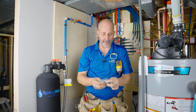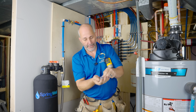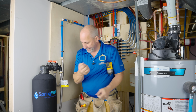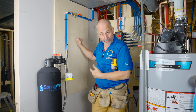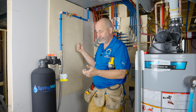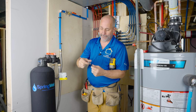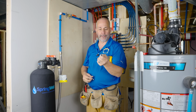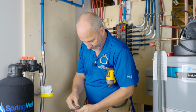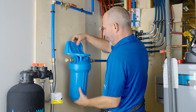All right, guys, now they come with a package of mounting bolts and washers. Hurrah. Hence the need for the plywood, okay? If you just have regular drywall, Lord knows if you're going to have backing in there. This goes with a number 13 size socket, okay? Brilliant, here we are. Pre-locate where we want to put all these.